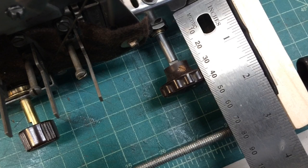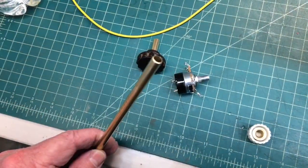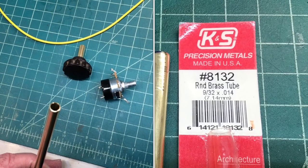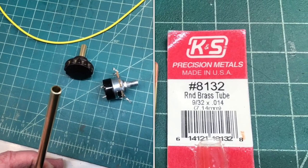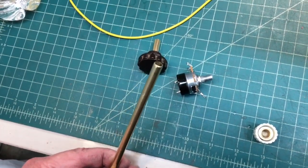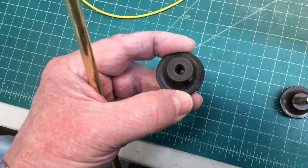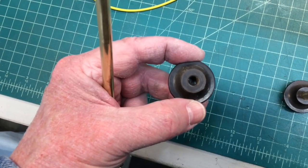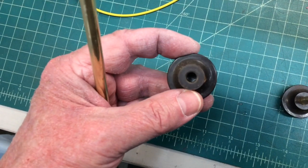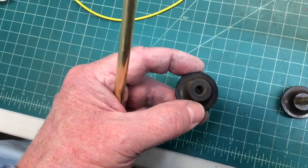I have a reference point here on the length of brass tubing that we'll cut. It's 9/32nds of an inch outer diameter, and that gives me an inside diameter right at 1/4 inch, or just a little bigger — so that works perfectly for creating the extension. Each particular knob may be different. This one has the set screw, so I'm going to leverage that, and I want to understand the depth of the inside of the knob to make sure the shaft extension is the correct length.